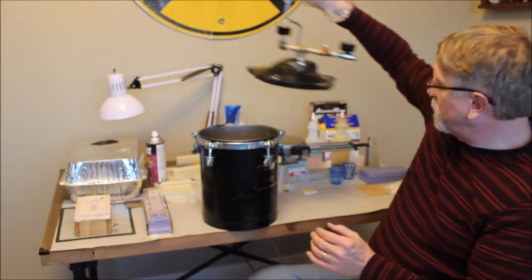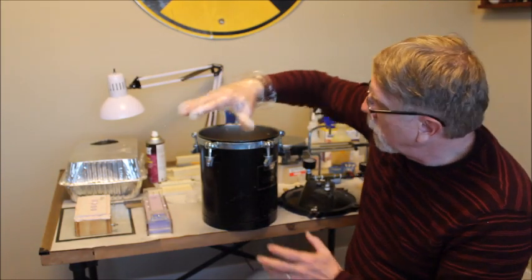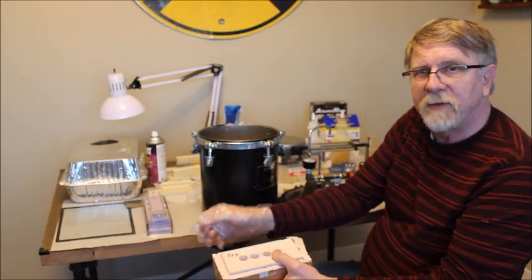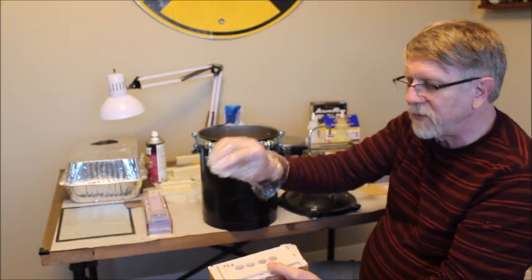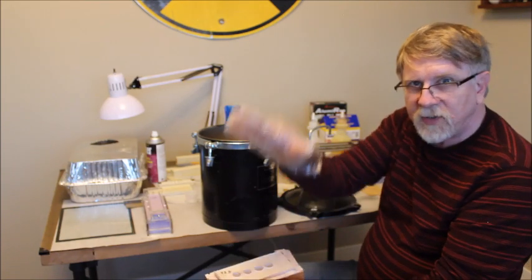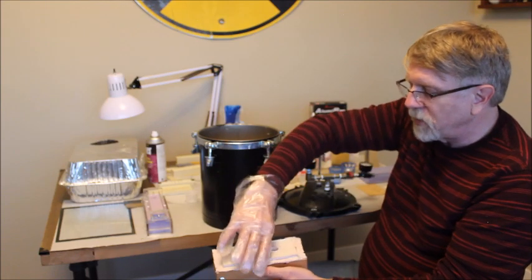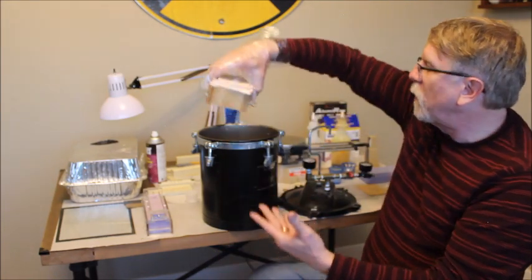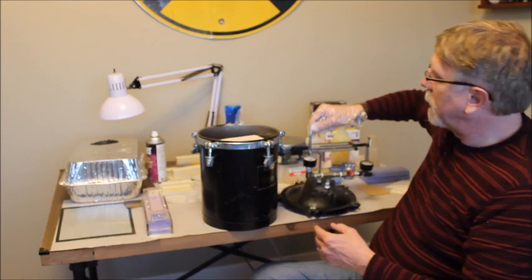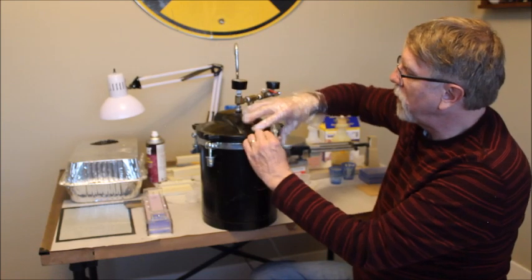So with this paint pot, after I pour my resin into my mold, so I have all mixed my resin, I've put any additives, I poured it in the mold, I tried to get out any bubbles in the parts that I could see, I put in the male portion of it to squish the mold. I now take the mold and I set it in my tank. I put the dogs on.